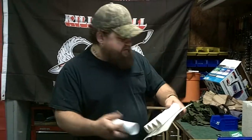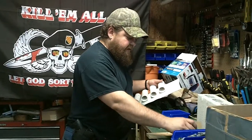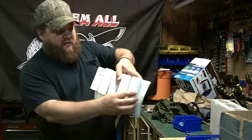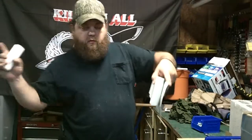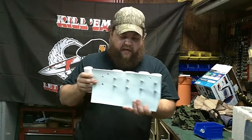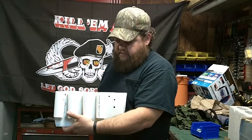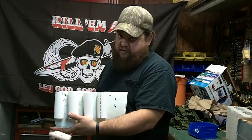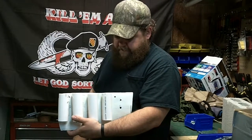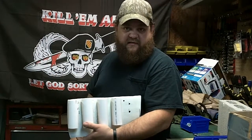Now what I'm doing is taking ¼ inch 20 bolts and little nylon nuts and mounting it here. I had two holes drilled in the side of the boat on the top railing where something was mounted at one time, and I'm just going to mount these there. We'll be able to put five fishing poles in, and it doesn't cost $8 a piece, I'll tell you that — that shocked me a little bit. When I get it mounted on the side of the boat, I'll show you what that looks like.